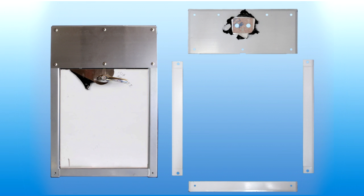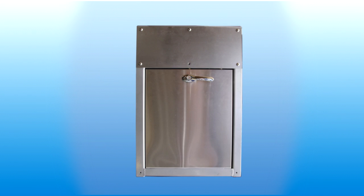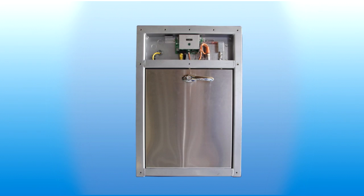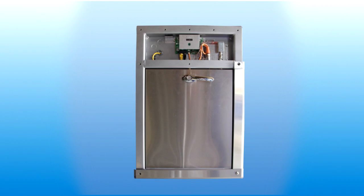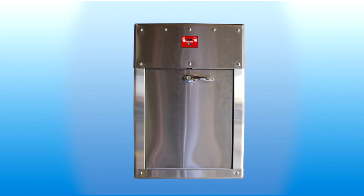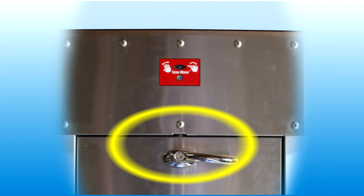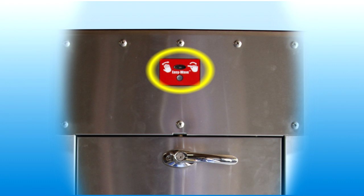During the final building construction phase and after the wall finish is complete, the protective cover should be removed, the stainless steel trim panels should be installed around the door frame, and the user interface panel should be installed over the control equipment compartment. Adjust final placement of trim panel pieces to provide clearance around all moving parts of the door panel, door locking latches, and the user interface sensors.